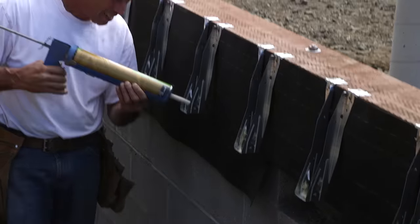Now there's another way that these joists could be installed or held up at the end of their span. Rather than the top flange hangers hanging down inside the crawl space which you've been watching, there's this other way we did here next to the garage in the space that will eventually be our downstairs bathroom. In this area, instead of putting the joists into hangers, we set them on a rough pony wall.